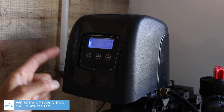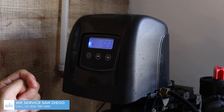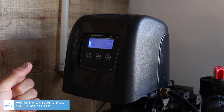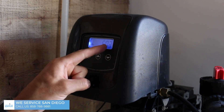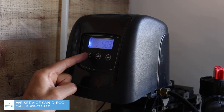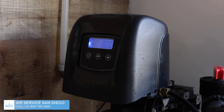The time of day is important because it dictates when the regeneration cycle will happen. You want it to go off in the middle of the night when you're sleeping — otherwise it's kind of noisy. Best time is 2 a.m. If the power goes out, you just want to reset that again by holding the buttons down to change the time, then hit the set button and you're good to go. If you don't have your time set, your 2 a.m. regeneration may happen at some random time when you don't want it to.